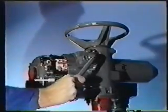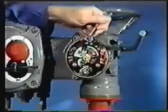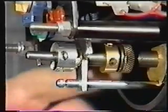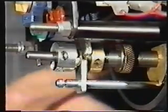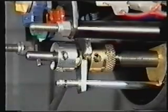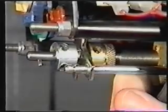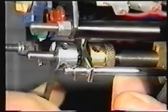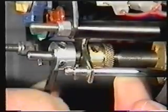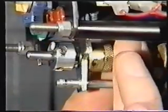Engage the hand wheel drive. For convenience, remove the indicator striker and the lamp. Release these two lock nuts and run them both back along the shaft, leaving them loose. Loosen this clutch nut at least 3 turns anti-clockwise. The screwed shaft can now be turned with the fingers.